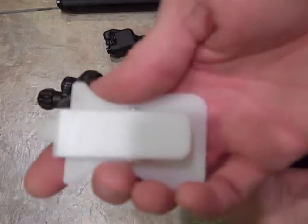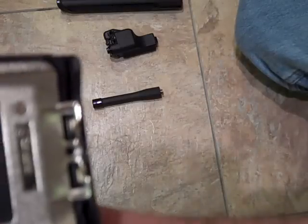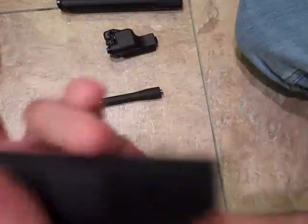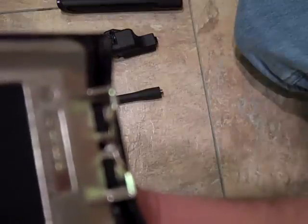You're going to need a special tool like this — Motorola makes them, costs about seven or eight bucks. Don't try to open up an XTS radio case without one, because you'll thrash it to pieces and break the o-ring — I guarantee it. It's made just for popping open cases. Make sure you have the antenna out and everything out of the way.